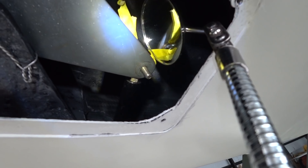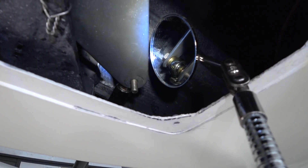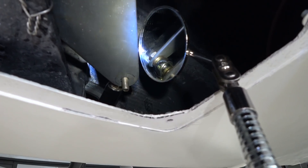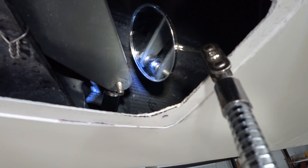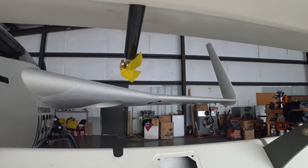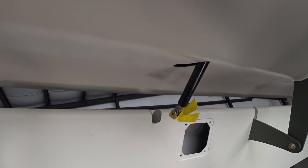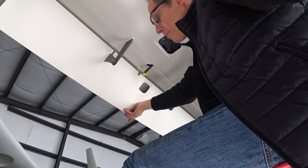You can see I've put it back in and the tape is there just holding the two washers together. I put a bit of tape on two washers so I can slide them in there and then when I'm done I can pull the tape out. You can see I've got two washers above and two below the rod end, in between the arms of the bell crank. Same thing on the other end — I tape my washers there to the end of the rod end and carefully put it up and slide it into the slot on the elevator.